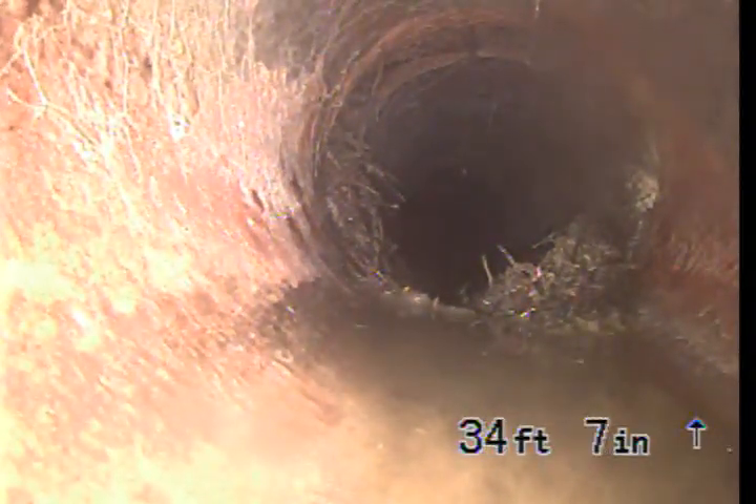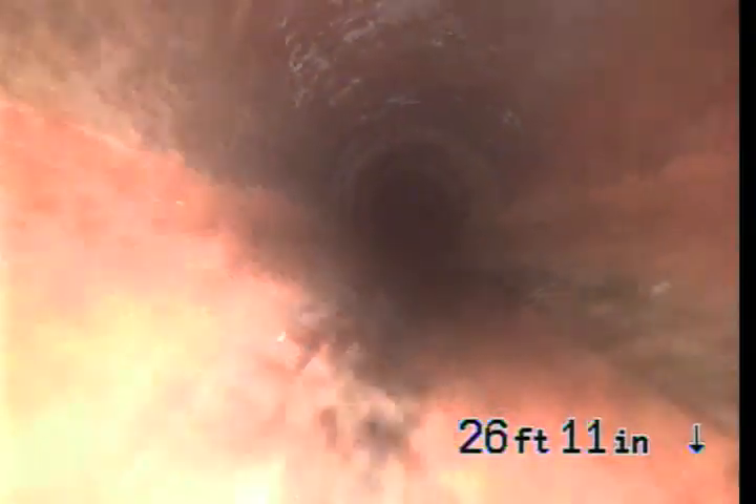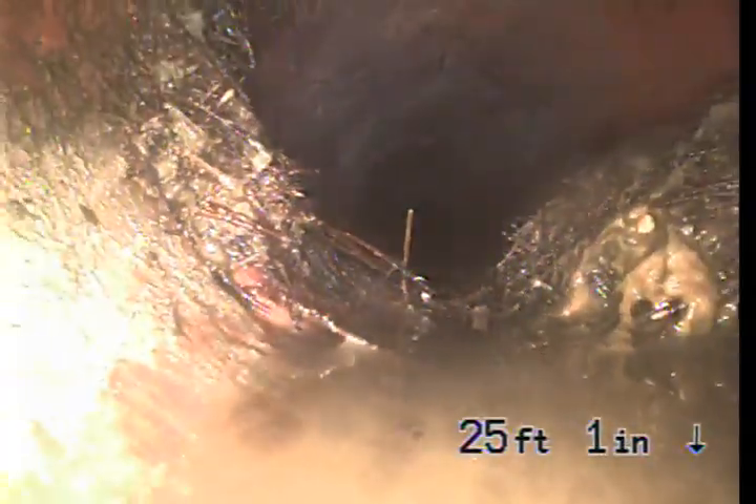See that stuff there — that actually looks like it's just come in through a joint. That's not that bad. There are a few of those where it's coming in through several joints, but that last major one could possibly be an issue. Keep coming — this is clay, original clay piping from whenever the house was built. Same thing, possibly through a joint.